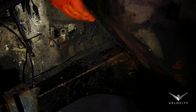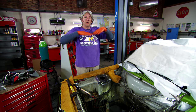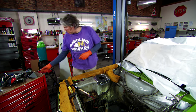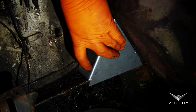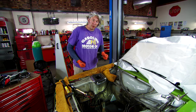Of course that means it's only going to pass the stress to the next weakest link in the chain. If you imagine you're going along on your rally course going over loads of yumps, the car's going to be trying to flex, and with too much flexing it's actually going to fatigue the metal — it's going to crack and break. So this little gusset here is going to pop into position just like so, and that's going to help give a bit more strength and pass that stress into the rest of the car structure.